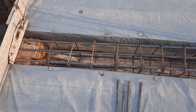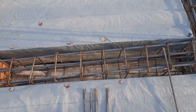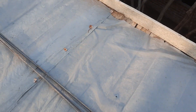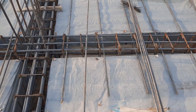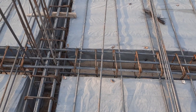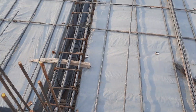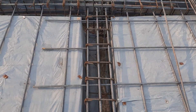As you can see, this is a cantilever beam — the length is more than seven feet. If you look at the steel reinforcement, it is wrong, because they did the design the same as a regular beam. On the top of this, they placed lapping to join other steel rods and extend the steel length, as you can see.